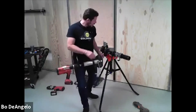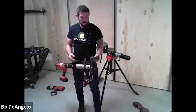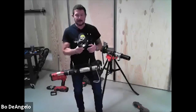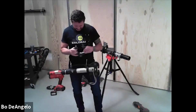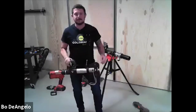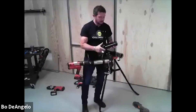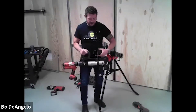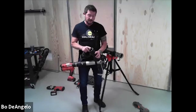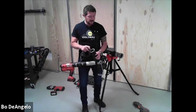It uses a ring — I've got a two and a half inch MegaPress ring here hanging off the pipe. This ring was used on the job, it's tired and dirty, but it's ready for action. I'll mark my insertion depth on this piece of pipe. It's not a perfectly square cut — someone cut that with a band saw.